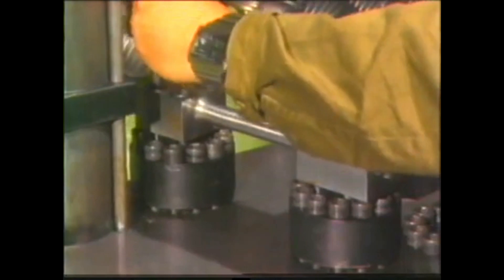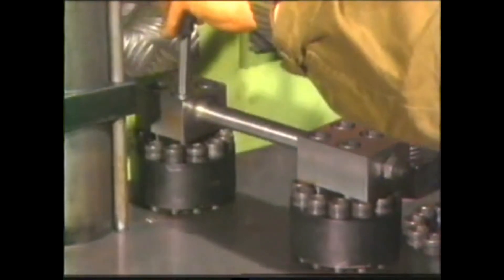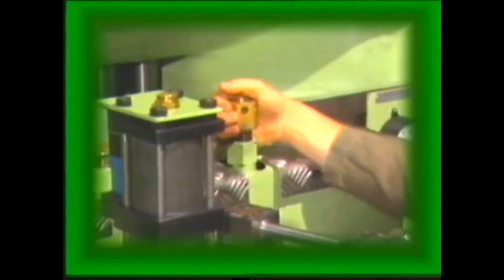After carefully adjusting and checking the fuel pumps, all alterations made in the course of the preparations must be restored to their previous state. Open the cocks of the fuel supply and return lines on the fuel pumps, place the fuel system under pressure and perform a leak test. This system does not have to be vented — the circulation valve looks after that.